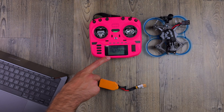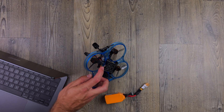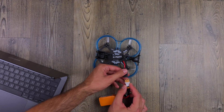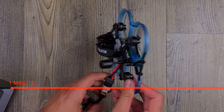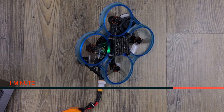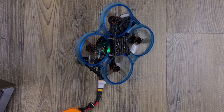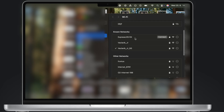When that's done, the Wi-Fi step for the radio is finished. Now we're going to do the same with the drone. I unplugged the O3 unit just to make sure I'm not burning the VTX — it takes only a few seconds if you know what you're doing, or some minutes if not. Plug in the battery and check the LED. It will blink blue; wait until it blinks fast — that means Wi-Fi is on (default is one minute). Then on your computer or phone, look for the Express ELRS RX Wi-Fi network and connect.